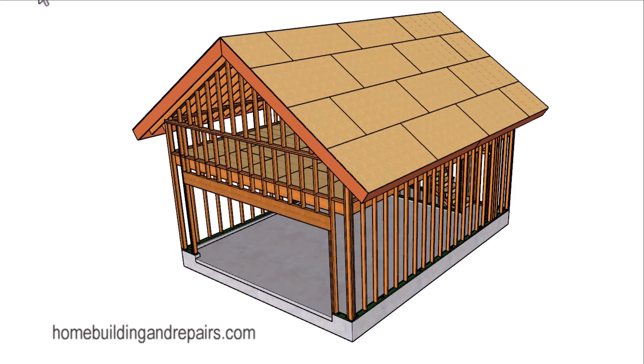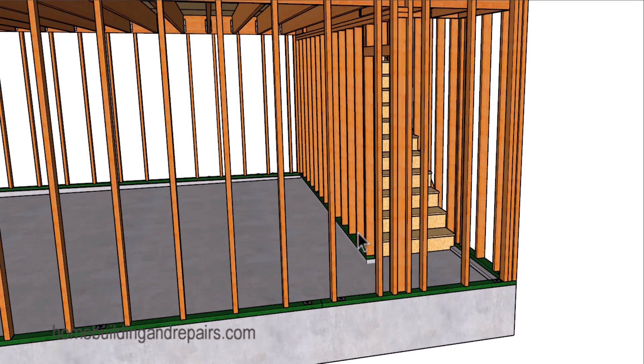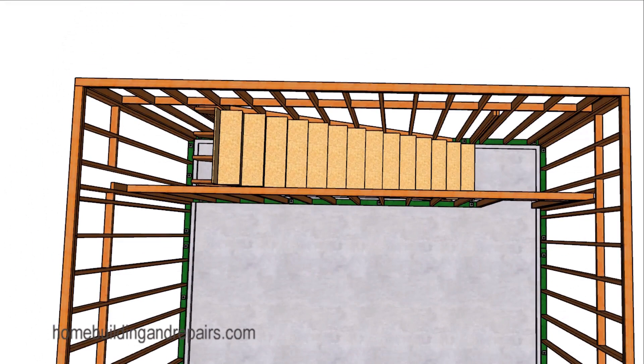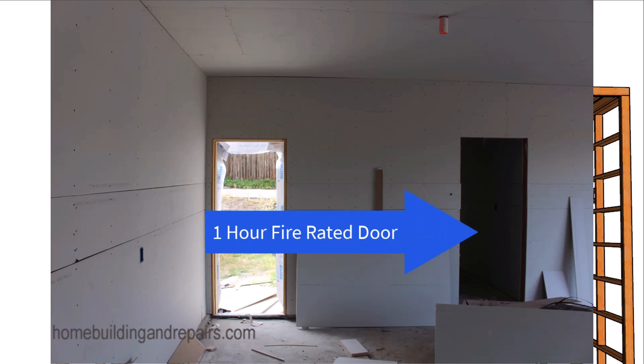Here is another one of our garage building videos, and this one we're going to go over the firewall. I don't think I have drawn one in any of the previous videos. However, somebody mentioned it and I thought it would be a good idea to point out that you might need some type of barrier in case the lower or upper section catches on fire. So what we're going to need will be a wall — 2x4, 2x6, or metal studs for the framing — and a one-hour fire separation, which will usually consist of 5/8-inch Type X drywall.